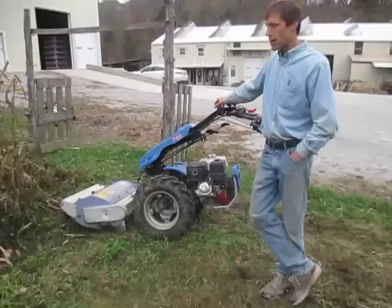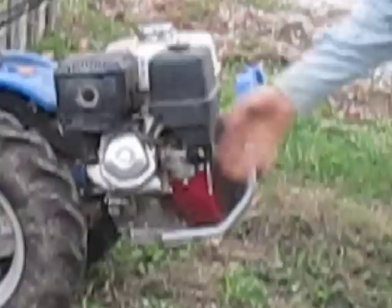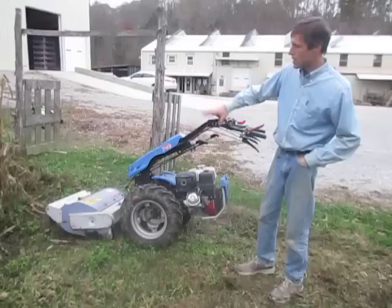The tractor is also equipped with a debris screen. This is a screen we retrofit to the engines here at Earth Tools. It's a perforated fine mesh metal screen that keeps chopped up grass from getting sucked up into the cooling air fins of the tractor engine and clogging up and making it overheat. So this thing is equipped, ready to go for flail mowing applications.